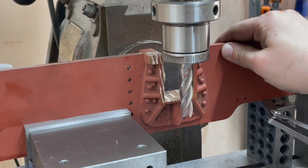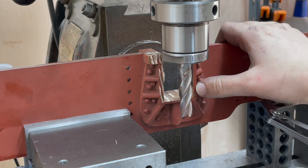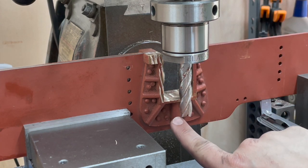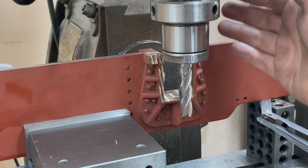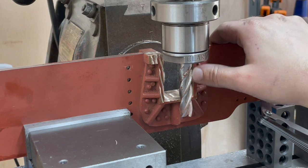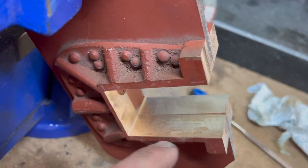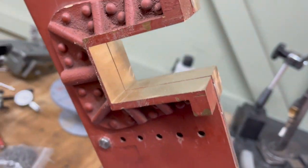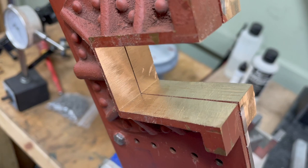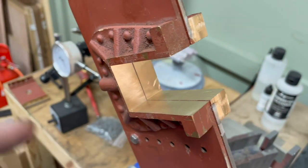I said I'd include the mistakes, and yeah — I literally finished both sides, they're within two thou of each other in thickness in the slot, and when I was just surfacing the bottom, the corner of the end mill caught the work, twisted the whole vertical head around, grabbed further in, and jammed the whole thing. Very, very frustrating. I've used a file to tidy up these slots — you can see we had a few chatter marks there — and the reverse of this side is where the damage happened.